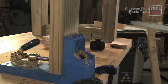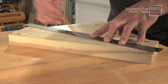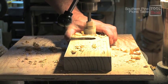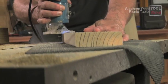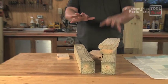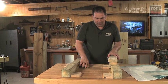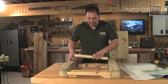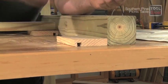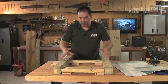We'll start by drilling pocket holes on both ends of the apron. Next, we need to drill a hole in the center of the stretcher to accommodate our dowel — use a Forstner bit the same size as your dowel to drill completely through the stretcher. Then soften the edges of the stretcher with a round-over bit. It looks like a big pile of wood right now, but watch as it's magically transformed into one of the ends of our picnic table. These little extra blocks are spacers placed under both the apron and the stretcher so they're not flush with either side of the leg.